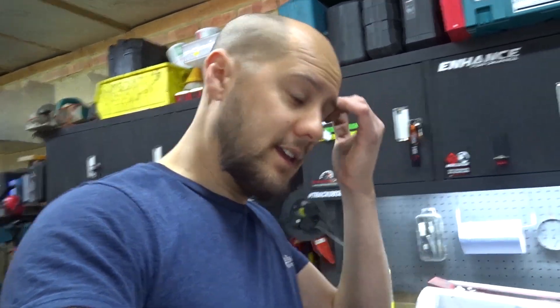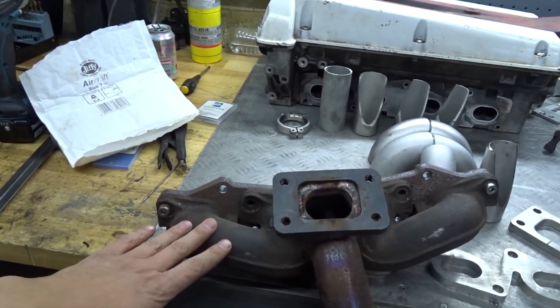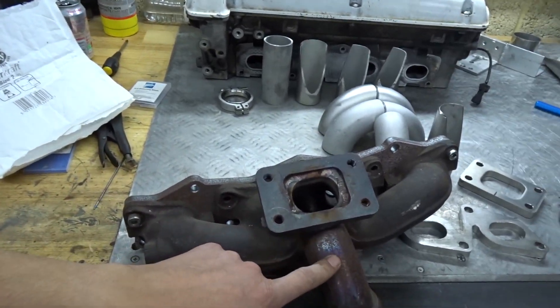The reason I've decided to make the manifold now is because it's always something I think is a bit of a rite of passage for someone who fabricates their own stuff for their car. Secondly, this is what I was intending to use first — a cast manifold with a flip plate to run it upside down. I welded a mild steel T3 flange onto it and put a wastegate fitting on there. Whilst I was under the car deciding where to put things, I realized that if I'm making a manifold the turbo position will change, the downpipe will need modification, and I'll probably need to make a few exhaust changes — so why not do it now.